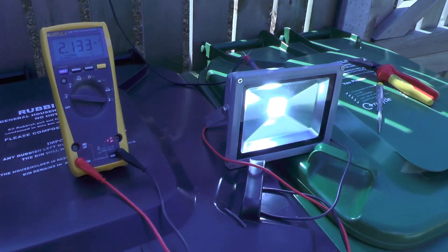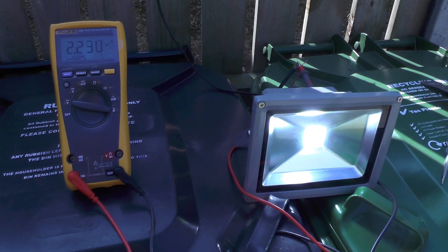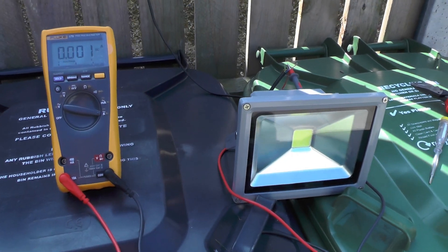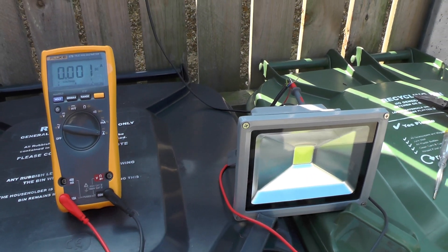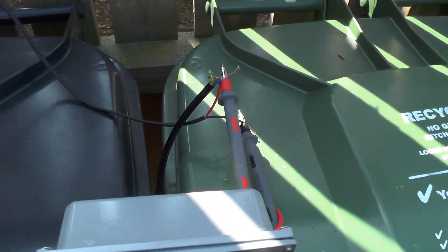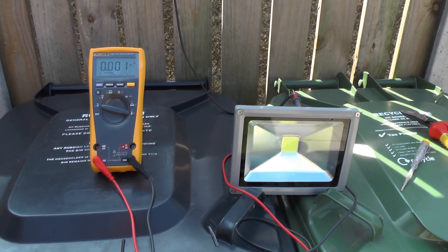Back to one — let's go aside and there we go, exactly the same amount of current flowing back through the neutral. So for those of you who had doubts about whether current flows back through the neutral, this scenario shows that it does. I hope this helped clarify things. If you have any questions, just ask and I'll do my best to answer.